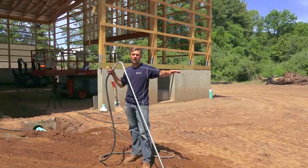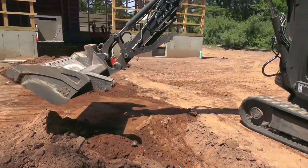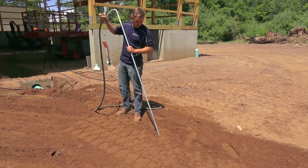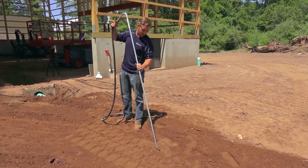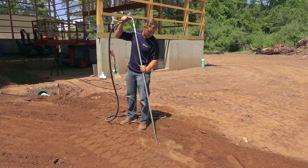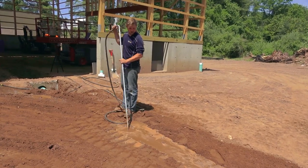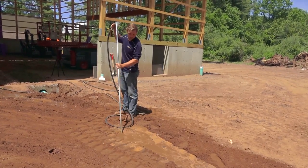As you can see, we've got our pipe backfilled. We're using the AquaPacker around the pipe, and now we're going to use it on top as well. You can see we tracked across it. A lot of times guys think that tracking on it is going to get them the right compaction. I'm going to use the AquaPacker just to prove that tracking on it is not going to give you the proper compaction — it definitely hardens it up, but it doesn't do the right job. There are some nice sandy soils, so it'll be dry here shortly, and we'll show you exactly how much water does for compaction.